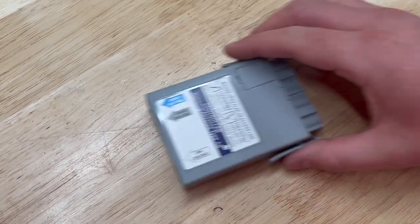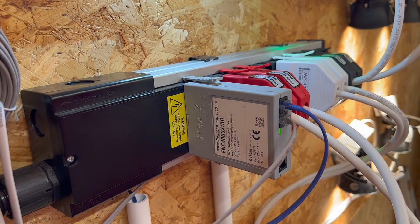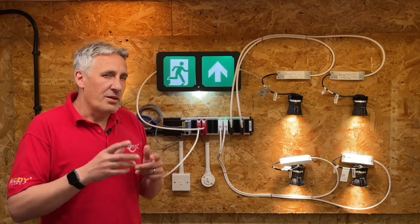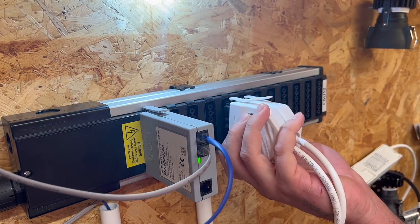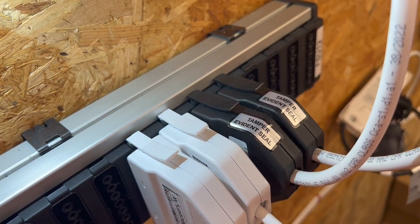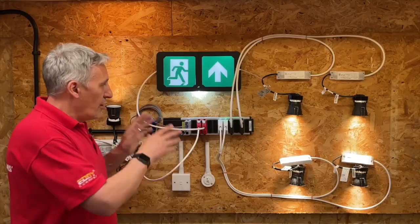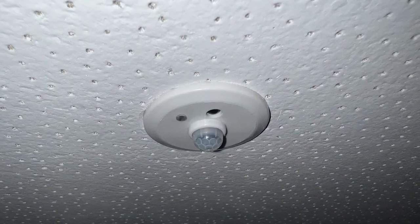This little gray box here can turn this modular wiring system into a fully functional, out-of-the-box lighting control system with minimal setup and commissioning. The control box plugs into one of the sockets, then controls the switched line outputs and broadcasts a DALI signal to the DALI bus, as discussed in our previous video. This means we can mix a combination of switched and DALI-dimmed lighting fixtures from this one box.